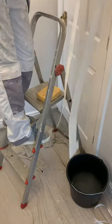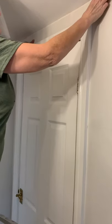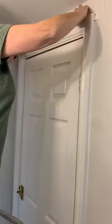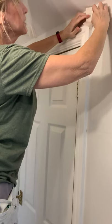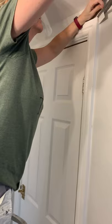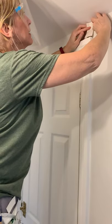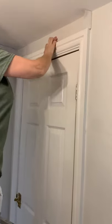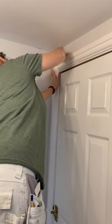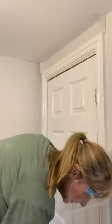Last bit — watch your fingers. This bit here, arrows at the top, same place. Same as I did the other side, I'm going to fold this piece back on itself — you can get rid of that bottom bit if you want, you don't need to leave that on. Fold it back, crease it, and make sure it's definitely pressed down really well. This side exactly the same, and when we come back and that's dry I'll be able to just tear them and it'll be a feathered edge.